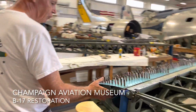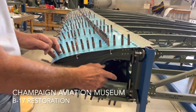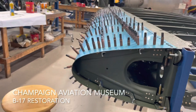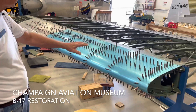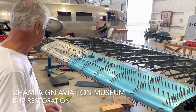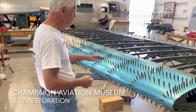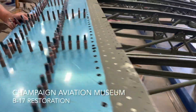These are removable — I assume because they got damaged often enough they had to take them off. There are actually pins and clips that they pull out, and this whole leading edge is a single unit. Right now it's clecoed up, and they're getting ready to rivet section by section onto the ribs. So this will be removable, and we can get to the inside of the wing to do the riveting on the corrugation. All right, let's go.